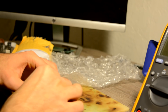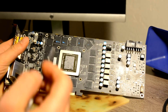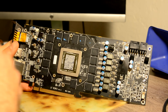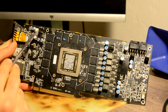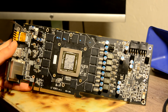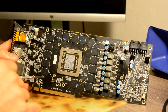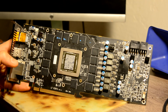We're going to install it and check how it works. Let's have a little talk about our graphics card. If you've watched my previous video where we also had a 390 graphics card, we had a problem with this phase area. Now, from what we see here, Power Color seems to know about the problem — that it sometimes gets overloaded — so they put a little radiator over here, which gets a little plus from us. But let's go from that little plus to our huge minus: there are no fuses at all.